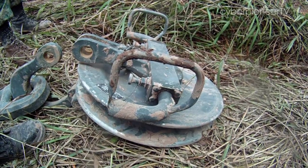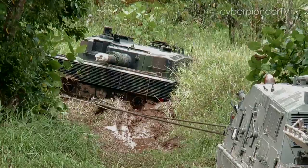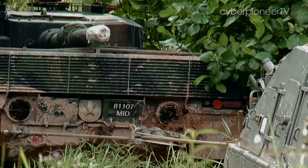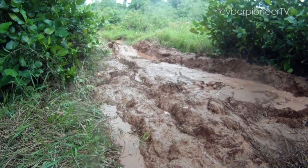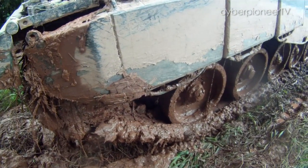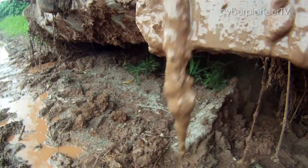With the help of a pulley block, the pulling capacity for this winching operation is doubled to help pull out the casualty vehicle, calculated to have a resistance of up to 70 tonnes. Different factors need to be considered when calculating the amount of resistance from the casualty vehicle, so that the recovery team knows which winching method to use.